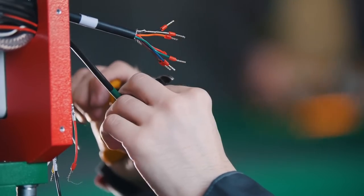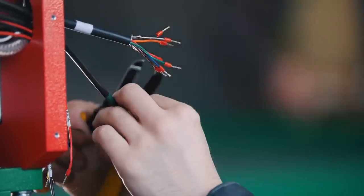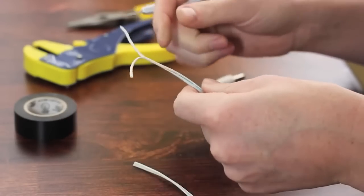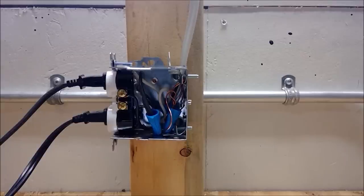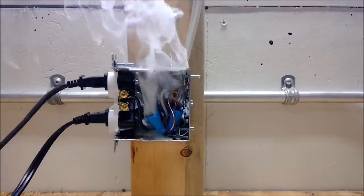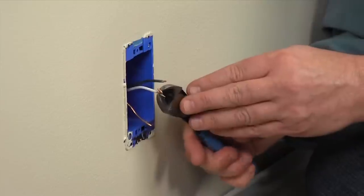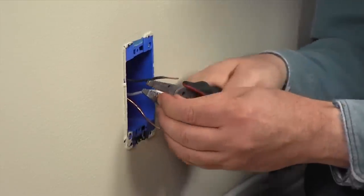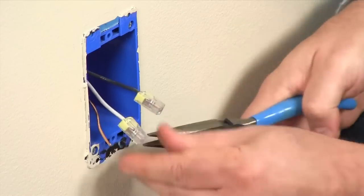The first thing you'll need to learn is how to cut your wires. If you're a first-time DIYer, don't forget that wire insulation has to be stripped off before you can cut it. When people don't strip off the insulation before chopping off the wire, they usually end up cutting the wires too short. That is dangerous because wires that are cut too short can cause poor connections in the circuit, and a short circuit can occur at any moment. A good rule of thumb: leave approximately 3-6 inches of wire from outside of the junction box. If you still end up cutting a short wire, it's a good idea to use a push-in connector to splice in an extra wire for that connection.